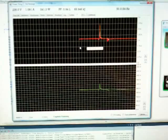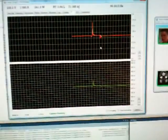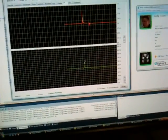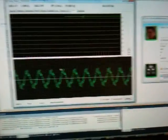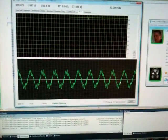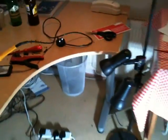Here is the current information. I've no idea what that spike is — I think it's probably because I turned a bulb on and off, or some stray movement in the wires which are not particularly securely connected. As you can see, power here about 250 watts, fairly stable current about 1.1 amps. Power factor hovering at around 94%, and there's the current waveform harmonics, mainly due to the presence of my high-intensity discharge lamp that I've been illuminating this room with.